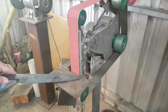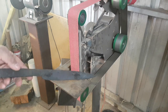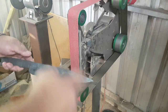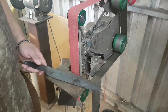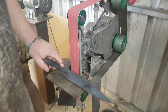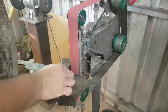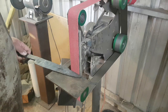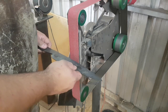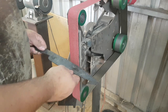The first thing we're going to look at with the tool rest is profile grinding. In any knife, the first thing you're looking at is the profile — the outside shape of the knife. This is forged 80% to shape roughly, but some blades will be less forged to shape, some will just be a bar of steel. If you've drawn your design out in a bar of steel, you're going to need to cut that design out on the grinder. The first method is perpendicular or horizontal grinding. I prefer to do this with the tool rest because it provides more resistance against the belt, which will try to pull the material downwards. You can move along using just the left hand and having the blade contact the belt rather than having to have both hands on it. So I'll just show you how I do that.